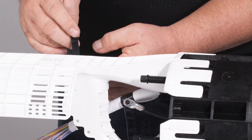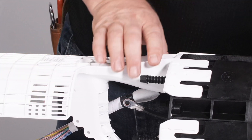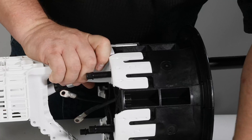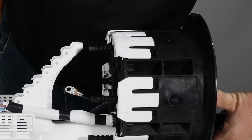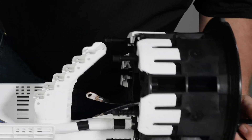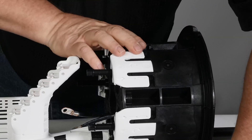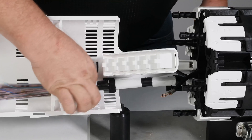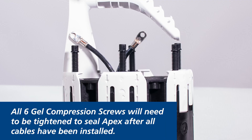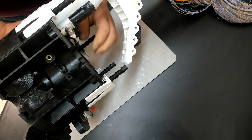Install material near the APEX basket yoke to secure backbone cable to the basket using Velcro or tie wraps. Once backbone cables have been installed and sealing wedges are secured, release the APEX closure from the stand and rotate it 180 degrees with the basket facing down, being careful not to damage any cables, tubes, or fibers. Secure APEX with the basket resting on the support and engage the locking tabs. Secure fiber, cable, or tubes on the basket close to the yoke using Velcro, foam retention, or tie wraps. Tighten all six gel compression screws prior to final assembly of APEX. Secure the APEX ground cable to the shield bonding kit before or after wedge placement.